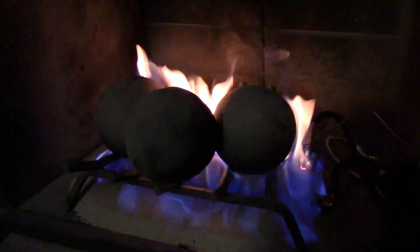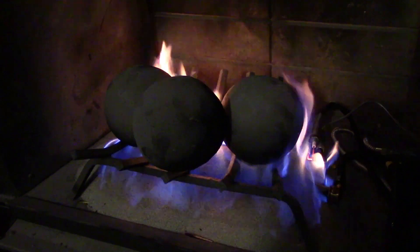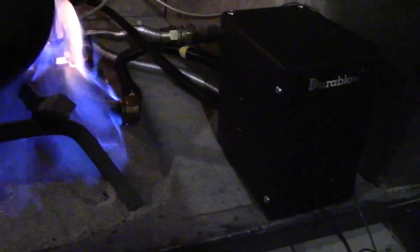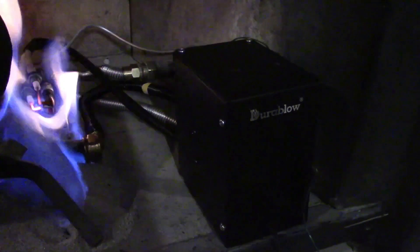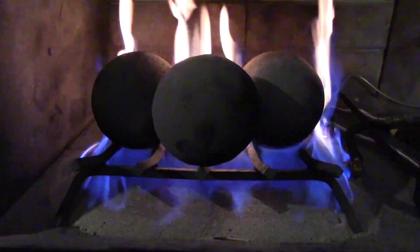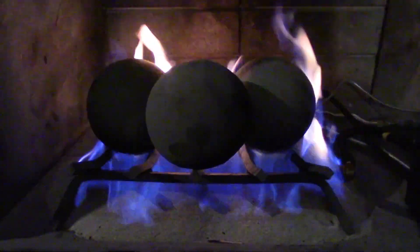So far I'm very impressed with this valve and controller. It runs very silently and looks like it's doing fantastic. I thought the temperature would raise a lot more than it has. It's been running for half an hour — it's a little too hot to touch on the outside — but the temperature inside the box has been staying much lower than I anticipated: only 136 degrees after half an hour. I think it's because of these vents that pull in fresh air from the back and keep things cooler inside. Because there's no insulation inside, I can see this unit overheating if it's too close to your logs, so you'll definitely want to put some kind of insulation or heat shield in between. But for this setup, only getting to 136 — I thought it would get much hotter. I don't think this is going to have any overheating problems if your setup is anything like this.